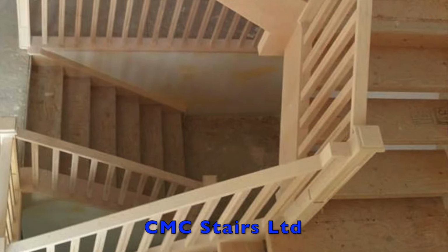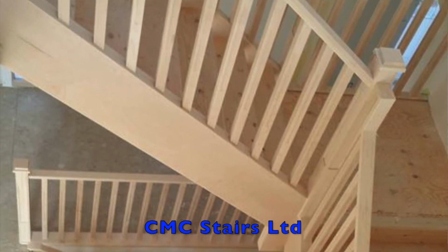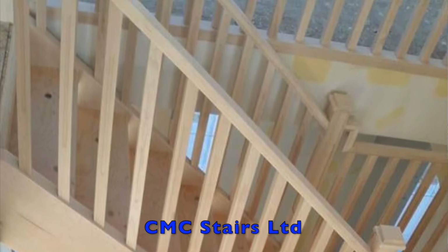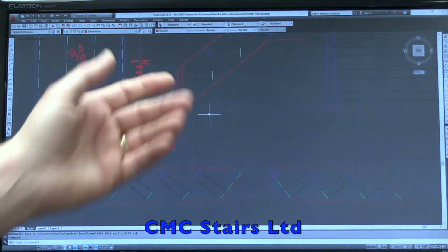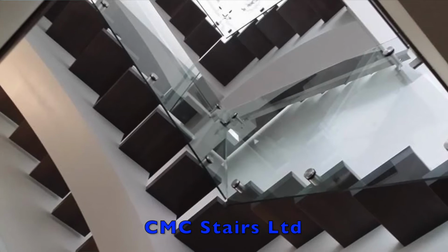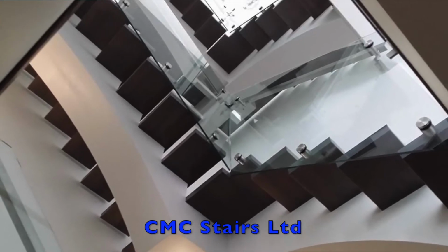So in the past, a lot of times we tell framers to back frame under the stair. I say back frame under the stair if it's a fully framed in stairwell, nothing's open about it. No problem. And you're only going to require a wall mount rail. But when you're doing more architectural, open rise, floating, glass, framed type staircases, other logistics are going to have to come into play.